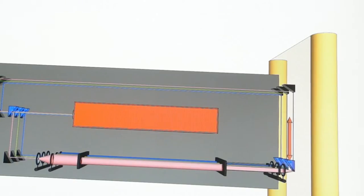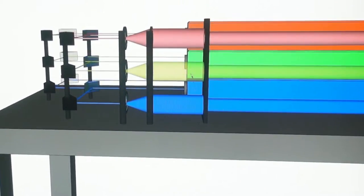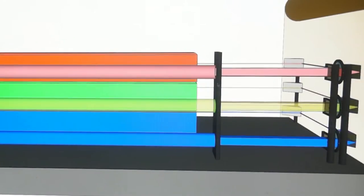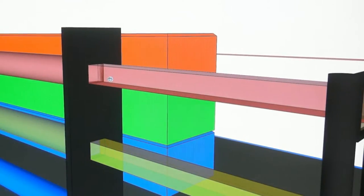The phase difference between the reference and the object beam when they meet on the film gives the information for that viewing angle. The two beams should travel the exact same distance to be coherent. The second beam passes through a lens system to be enlarged, then through a square hole that fixes the holopixel shape.